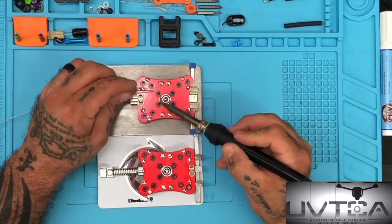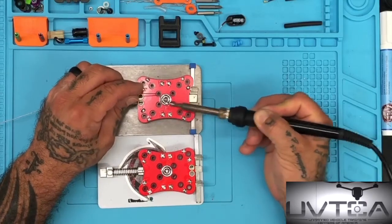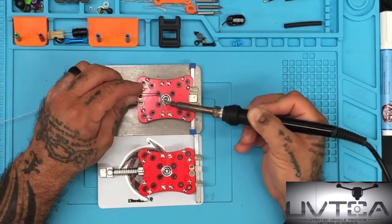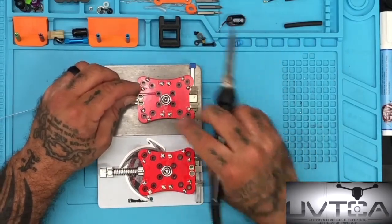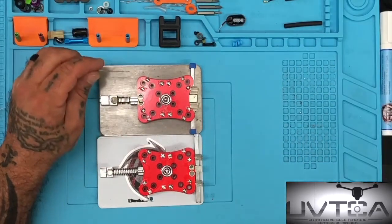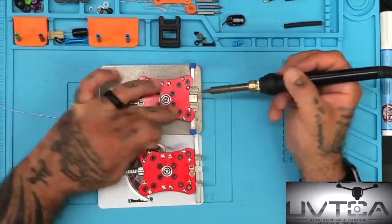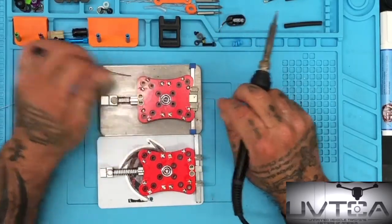As far as your circle goes, there's a ton of solder on here, and that's bridging it. So I'm going to try to scoop this bridge off, like that. Okay, now the bumps are gone. Solder's really easy to manipulate, so you don't have to worry about that. Then you come through and clean up the little specks you got. And it looks great.